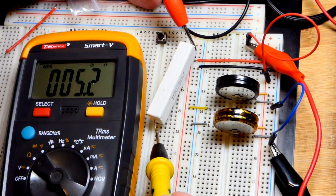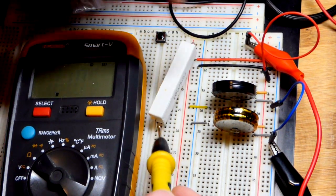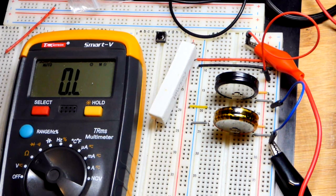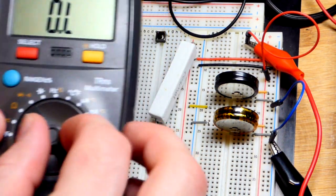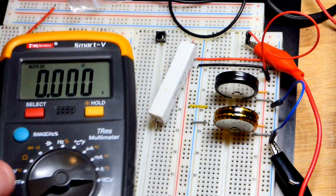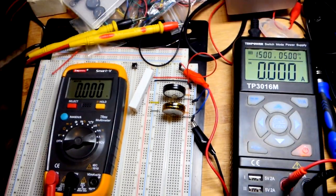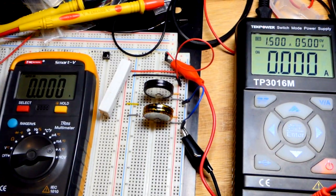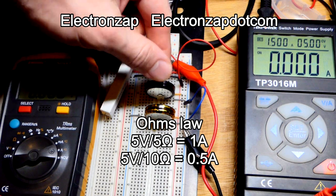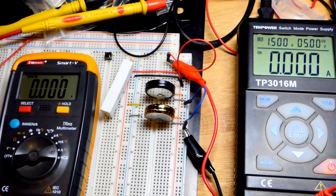You can go to the metal wire and get the same reading — they are a direct connection. None of this resistor is electrically connected to anything else right now. We're going to go to measuring current, amp range, 10 amp or less setting. We have 5 volts at these supercapacitors, and if we take 5 volts across 5 ohms of resistance, we expect 1 amp of current by Ohm's law — that assumes no internal resistance. If they have internal resistance, it will be less current.